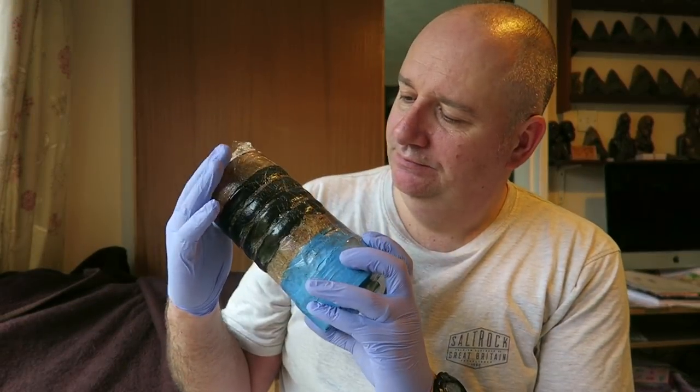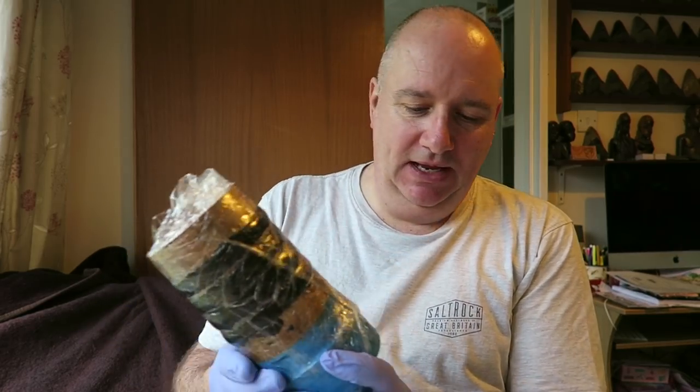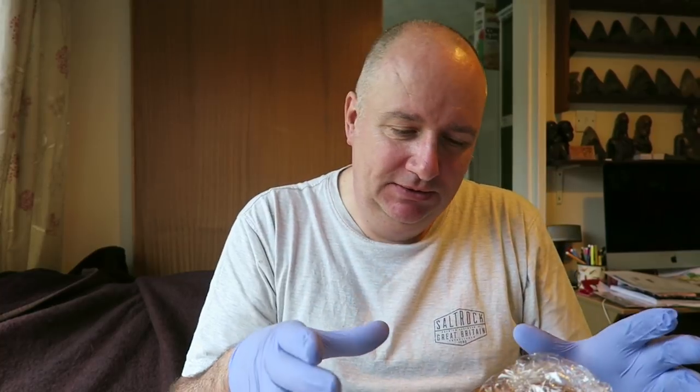Well, there it is — all carefully packed. When packing it I tend to put a hand on both sides like that so I'm pressing evenly, which avoids displacing the ring of Milliput. The aim by squidging all the way around is to get rid of any voids and push the resin up into the grain on each side. Since they're both epoxies they'll bond directly together and it will be very, very strong. I'm hoping it doesn't all fly to pieces — I could end up with a load of very small bangles!